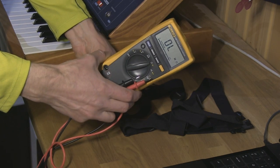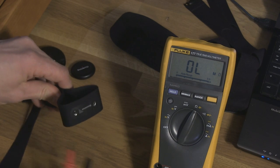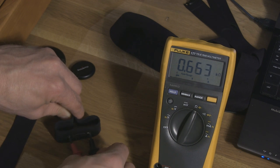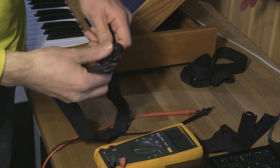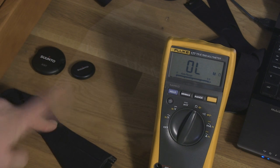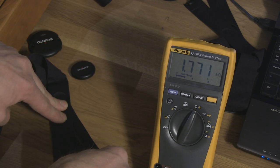You need a multimeter — set it to measure resistance. Keep pressing the pads together while measuring the resistance between the contacts, and then observe the resistance from the meter. It should be less than 10 kilo ohms. This belt is in really good shape because it's less than 1 kilo ohm. You can do the same test with an older heart rate belt which is not Bluetooth but ANT. Remove the module — it's a bit more tricky with this old belt, so you probably want to keep it on the table. Remember pressing the pads together, then measure the resistance between the metallic contacts. Now it's 1.6 kilo ohms, which is pretty good.